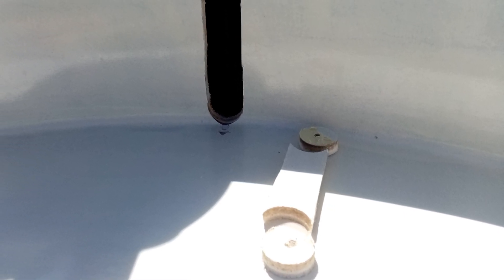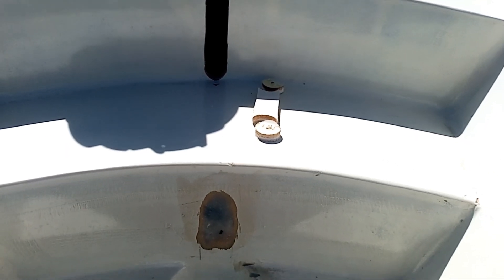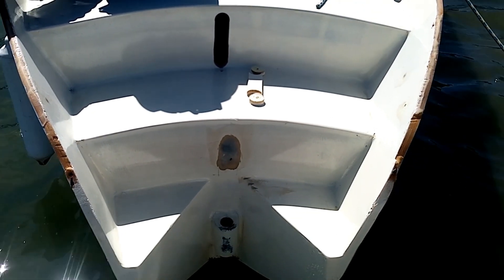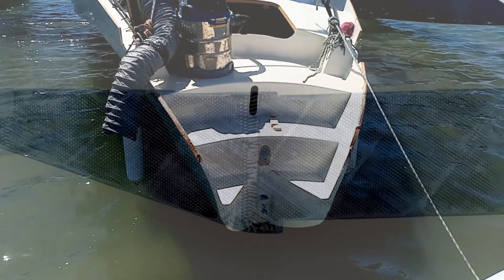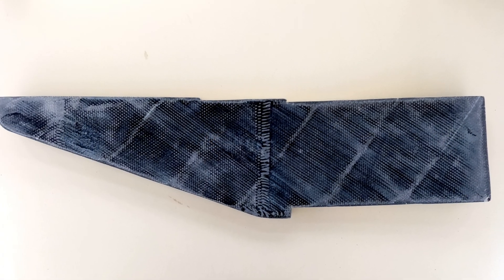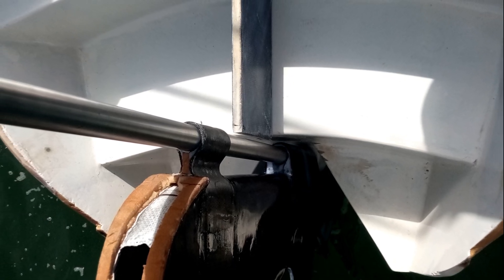We're cutting a slot in our nice new steps, because the bulkhead that's going to hold the rudder hinge needs to be strong — it cannot just be glued on top of the step but must go through the steps and also be glued on the inside of the new transom. This bulkhead is made of carbon fiber, and three of those bulkheads will poke through this step and be glued underneath, coming outside towards the pipe in a triangle. That bulkhead needs a pipe on it, obviously — and the rudder had to be there because that pipe needs to be perfectly lined out to make sure the rudder keeps working.